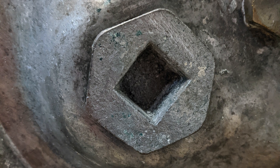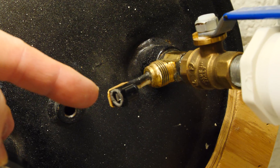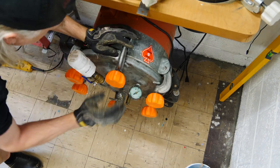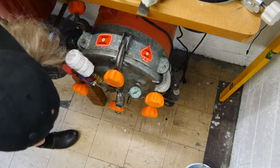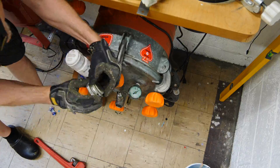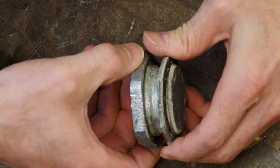We're going to use this nut as our pass-through point as it's removable so that we can machine it. I already have something like this on my smaller tank and it works great, although it's only two leads. Thus, we're going for something a little bit more here. I'm also going to use it with a heavy-duty wire so that I could pass 110 volts inside the tank should I ever need to do that.